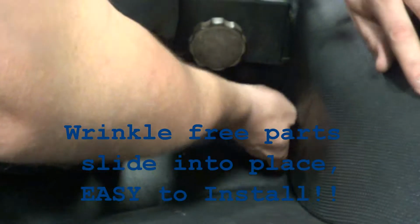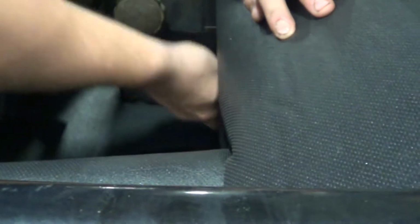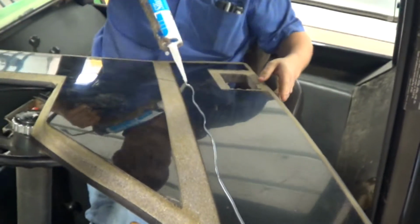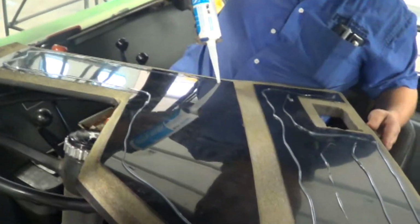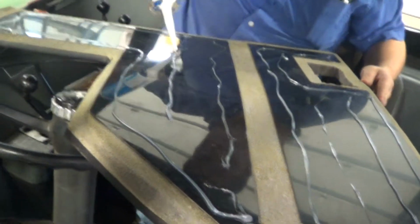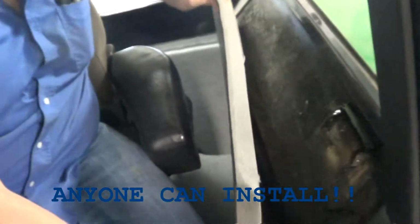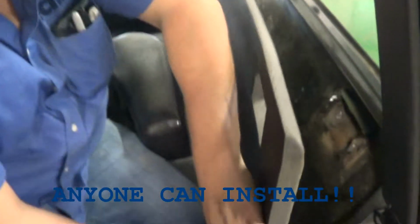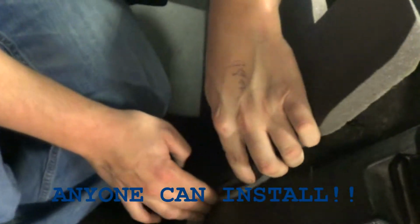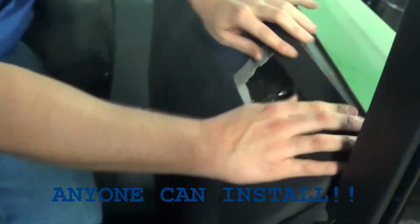Here's another backside view here. We're going to curve this right wall down and press it into place here. Now we're going to move on to the left wall. Just put caulk into place here and around the perimeter, and real quickly here. This one here, you've got lots of different angles and different points, and when you're gluing these in with the spray can adhesive, this is a tough part to put in. When it's on caulk, you can pretty much start it anywhere, and you've got plenty of time to move it around and slide it into place.